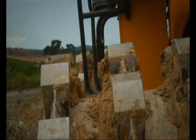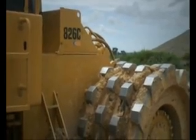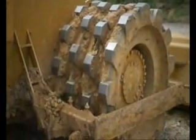The four reasons that are in our brochure and on our website are the basis for our confidence. One, the fully cast feet — instead of the long narrow feet on the CAT — lead to several gains. The fully cast feet has no voids; it incorporates self-cleaning plates and is tapered to the base so as to save drag.